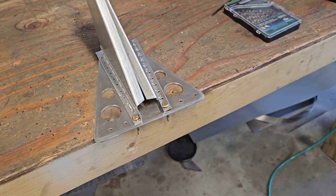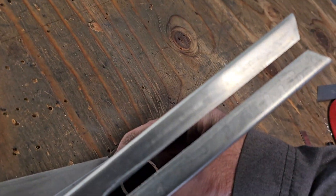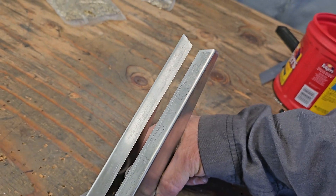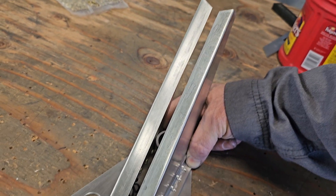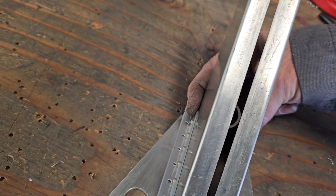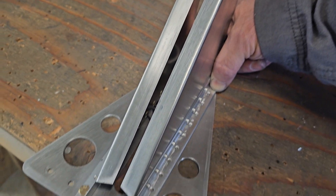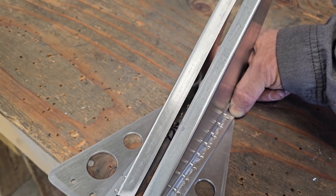In order to drill the holes down in this plate, we've got the piece of tubing down in there sandwiched together because it needs to be a tight fit on both sides of it. So now I can just start drilling down into the workbench on both sides, and that'll give me my holes through the plate, and then we can rivet that on.